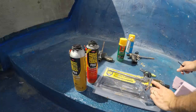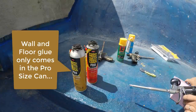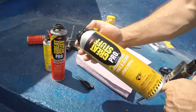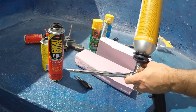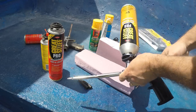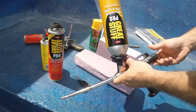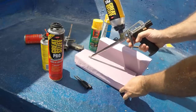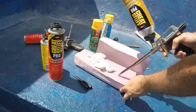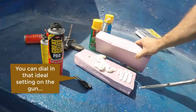This is Great Stuff — they're not a sponsor, although I have bought enough of their stuff that you could say I was one of their sponsors. I got it because it's the only way to use their wall and floor glue, and I wanted to use it for gluing the insulation to the roof here, to the concrete. Basically the can just screws right on the gun. Then you open up the dial in the back to free the trigger and set the max flow rate. When you pull the trigger it's proportional — pull a little and you get a thin bead; pull it halfway and you get this nice ideal bead that's perfect for gluing these panels together. This is the best stuff I've found for gluing these layers of insulation together.